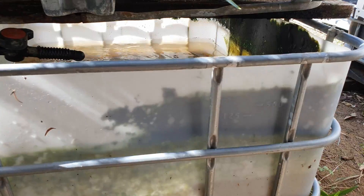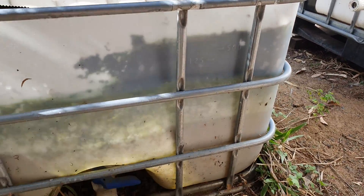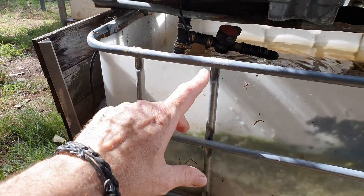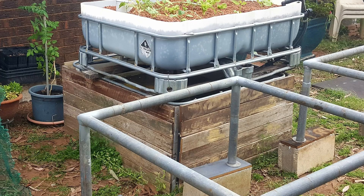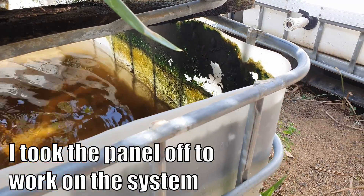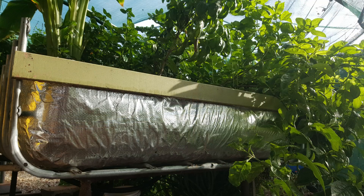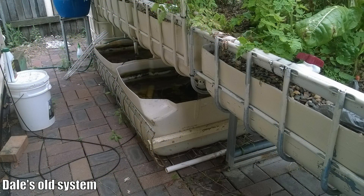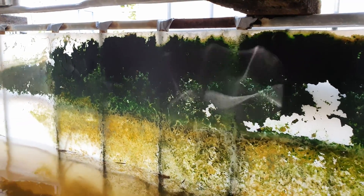From this angle you can also see another issue: a load of algae that has built up on the tank walls, because this side of the tank was never covered. There's a wooden partition on one side and something blocking sunlight on the back, so no algae grows there, but this side gets morning sun and that encourages algae growth. If you don't want to clad your tank, you can wrap it with sarking — a silver insulation sheeting — or paint the tank using products that bond to plastic, creating a coating that stops UV light getting through and allowing algae to grow in the nutrient-rich water.